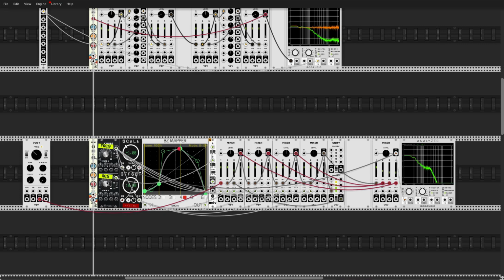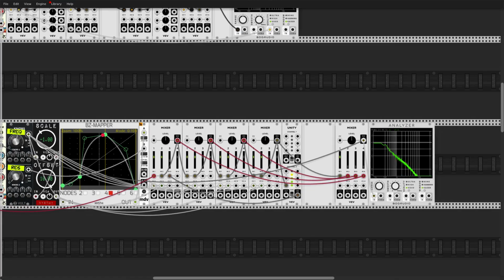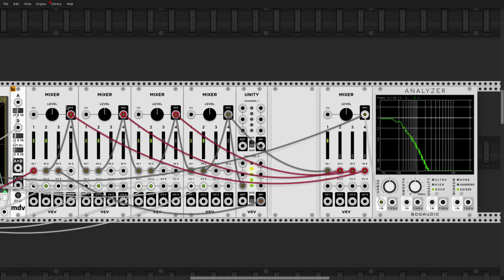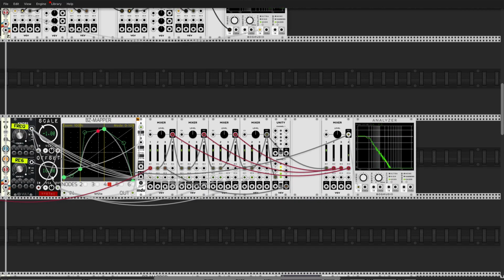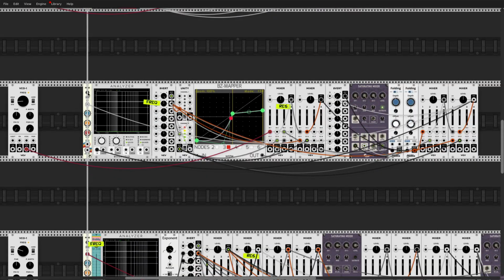And another little improvement here, this is what I like doing. You see, I love very steep filters like 24 dB, but then the sound is also muffled. Normally it would sound like this. It's very dark. But here I took signal from different stages, so it's technically a feedforward filter from different poles, and mix them in. So basically you can add that bit of buzz. Very nice, and also you can mix and match to your liking. So that's my variant here.